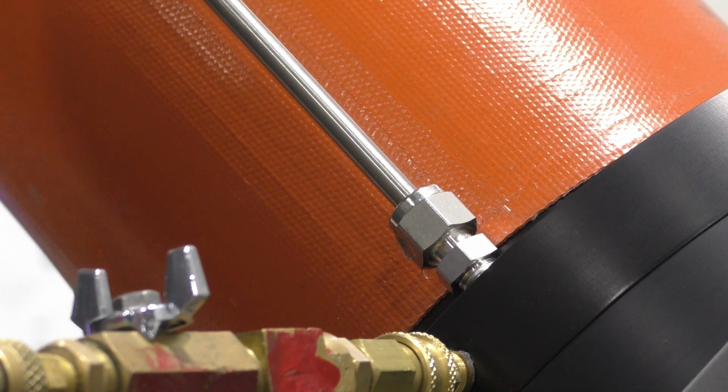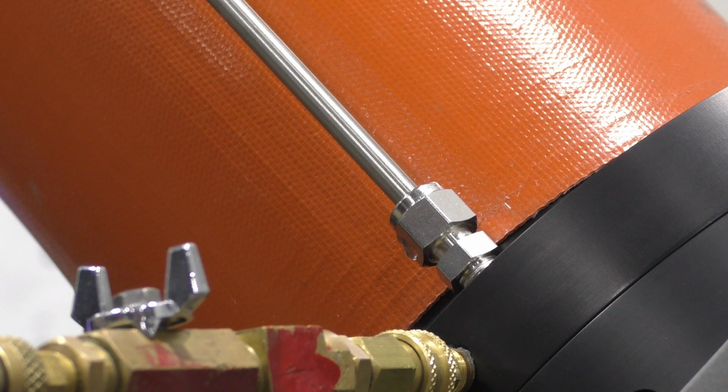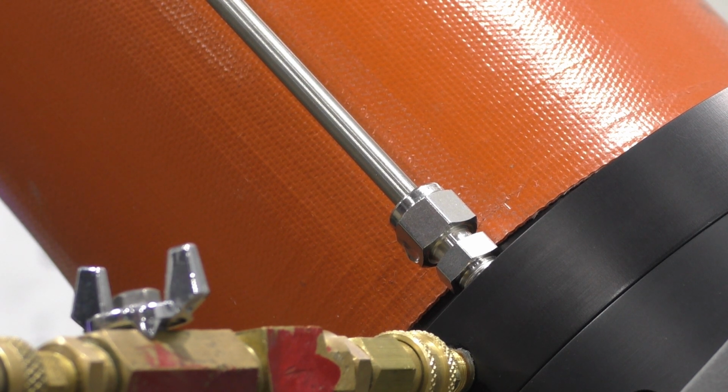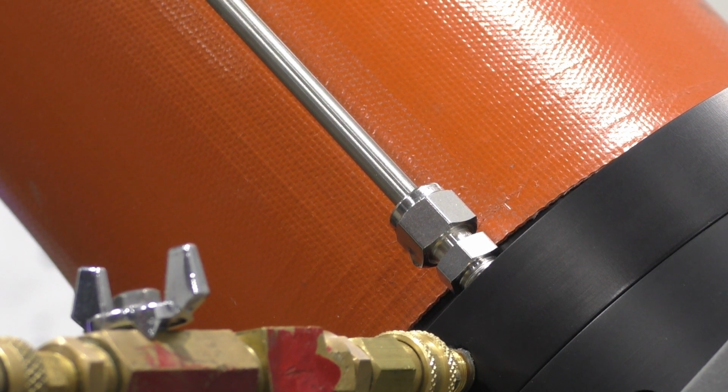Make a note of the current pressure and wait 15 minutes. If the pressure changes less than 0.3 pounds per square inch in 15 minutes, this is considered acceptable. If the pressure drops more than 0.3 pounds per square inch, continue to look for leaks. If, after checking the external connections like tubes, the meter still shows a drop in pressure, other areas must be checked.